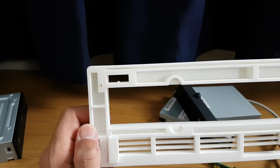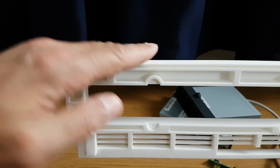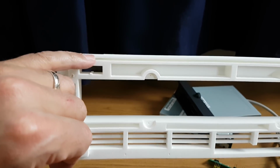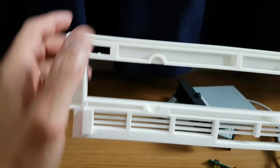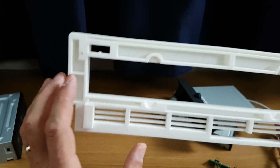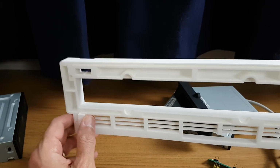You can see I've had to remove a lot of material, so there are a lot of holes made out of it. But if you see this slot at the very top, that's where the case lip goes. The case, in theory, will come flush with the top, but then there's a lip that goes down and drops into that slot. The reason for that is so that when you push on the lid, it's being supported by all this material, and it should make it nice and strong. In fact, it doesn't have to, it's only the slight bend in the front that you stop. The real strength will be in the sides and the rear of the case. So you should be able to put quite a heavy monitor on the top.